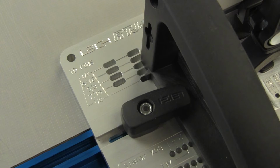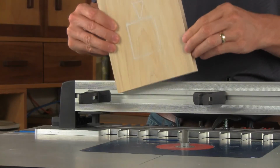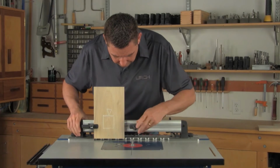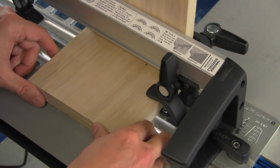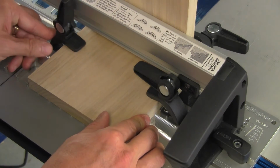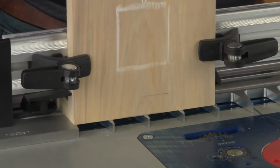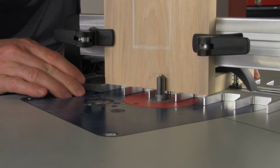The frame pin position is determined by the diameter of the dovetail bit used to route the tails. Place a test pin board flush on the template, with its edge against the side stop, and clamp it in place. Insert a new backer board tight against the pin board. Use a tail board to set the bit height and pencil a line across. Then adjust the bit to the center of the pencil line.